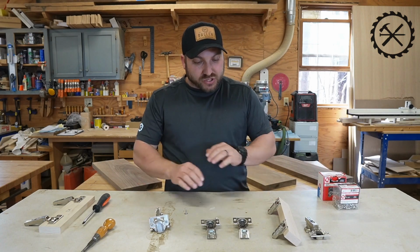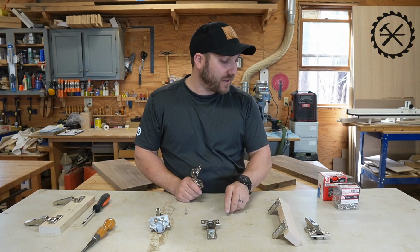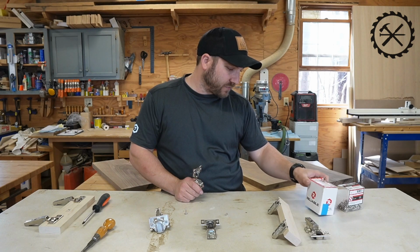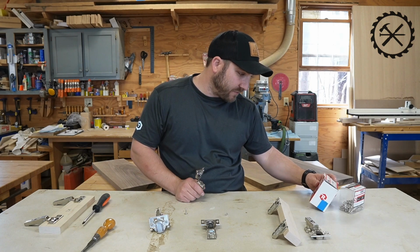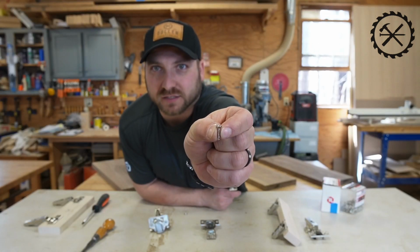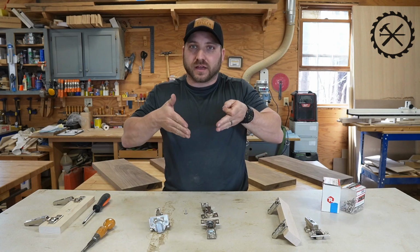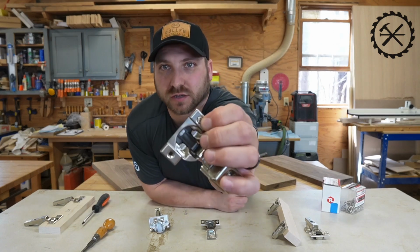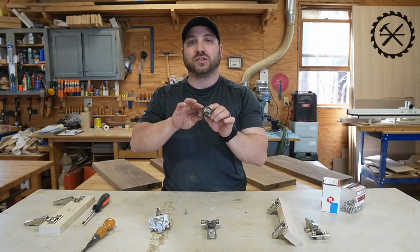Now, first, all of these hinges, to screw them into the actual door, I use these, which are a 5/8. What is it? It's an 8 by 5/8. I think I took off the little part of the package that says. I believe they're a number 6 by 5/8. I can put that in the description for sure, but they're very tiny, it's probably hard to even see. And these are not pan head. These are 5/8 long, and they have a pointed end so that it sits in the hinge relatively flush. If you can see that. So all of these hinges will use these screws to fasten them into the door.